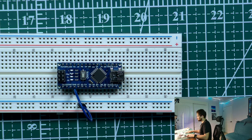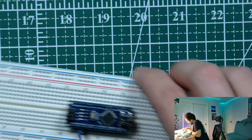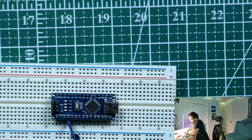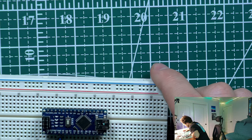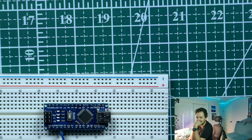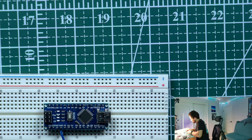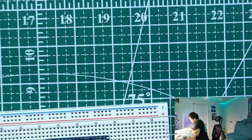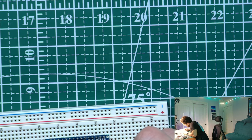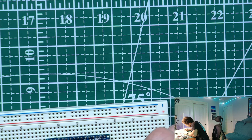Okay, so we are here, right? So what I'm going to do? I have these resistors and the long leg of a LED to pin 2, 3, 4, 5, to a digital pin, right? We need a digital pin. To the digital pins. Okay, so digital means D, analog means A, right? So long leg we are going to have here, digital one. But I do not have enough.